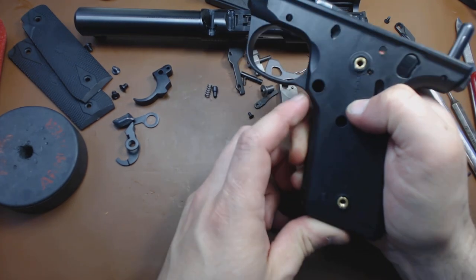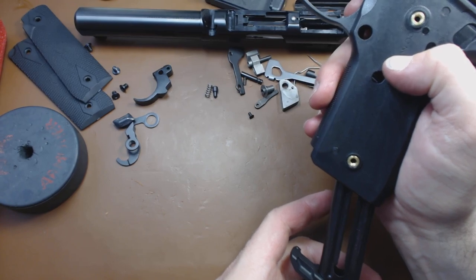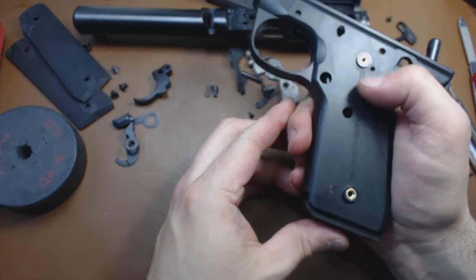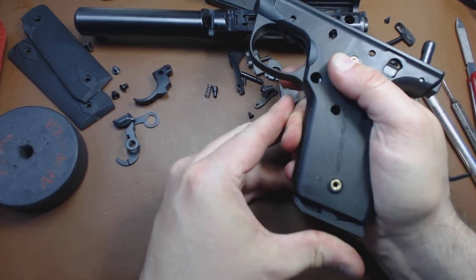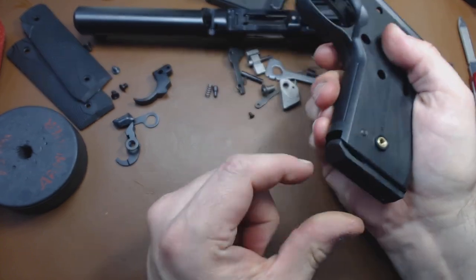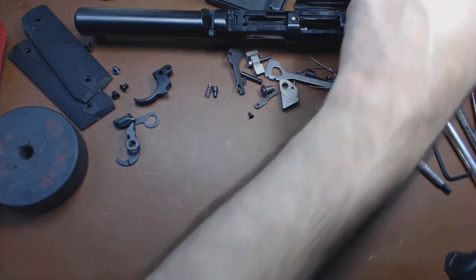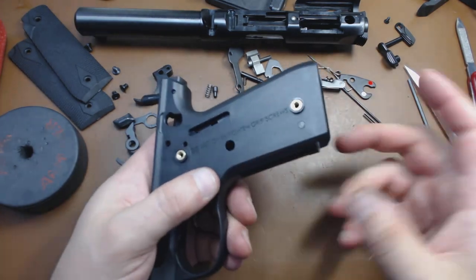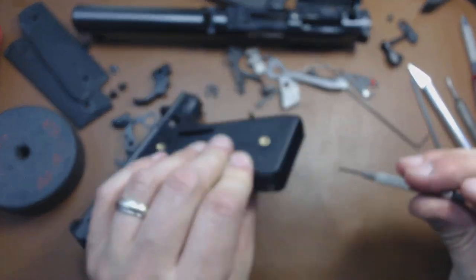And if you jostled the gun or took that first shot, you would find the magazine fall right back out. And so in order to avoid that, you have no doubt anymore. If it stays in, it's because the magazine catch caught the magazine. Otherwise, there's a big old button down there that pushes it right back out. It also helps eject. Once you push that button, you're going to get some extra force ejecting it from the gun. And it's a really simple mechanism.